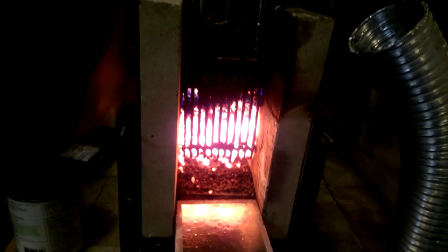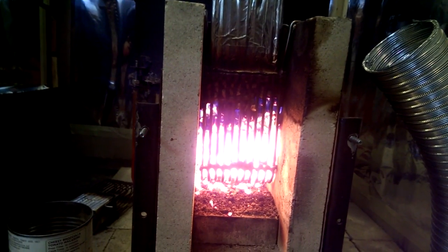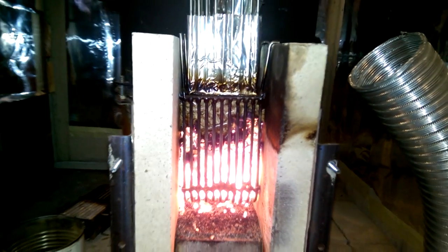You can see just how they burn in the fire basket. That's how it burns in the fire basket, and that's as far up as it will travel — it only burns in the region in front of the horizontal burn tube. That boundary layer is as high up as it goes, maybe just a little bit higher. The air traveling down the firebox opening from the top down helps keep the burn contained into the lower portion of the firebox.